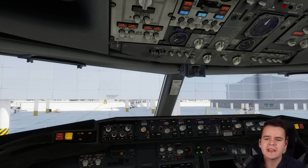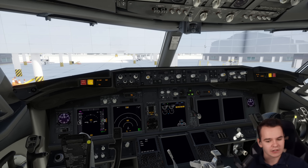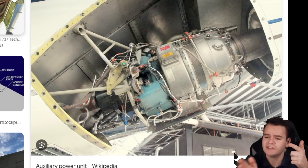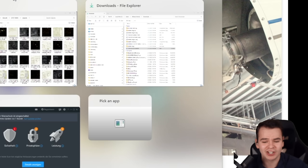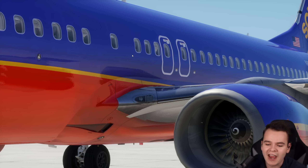We can see the APU available light. And we can hear especially air coming in. The little APU engine provides our airplane now on the ground with air — especially cool air, very good for summers. The generator in this engine provides the airplane with electricity, and for starting up the engine, we turn on the APU bleed, which sends air into the jet engines in order for them to start up.